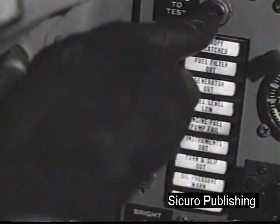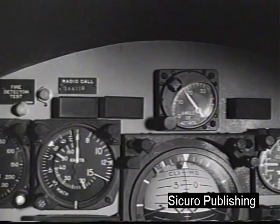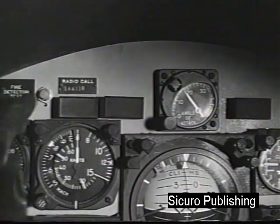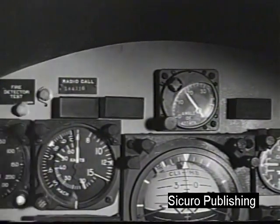Press the annunciator panel test button. All segments of the panel should light. Press the fire detector test switch. Both the aft overheat warning light and the plenum fire warning light should go on.